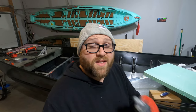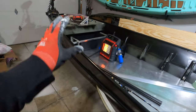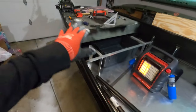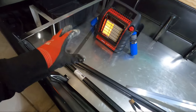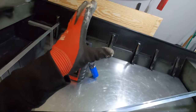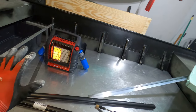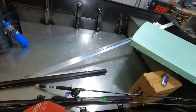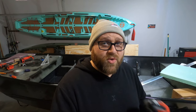As I mentioned in the last video, I've been waiting on a delivery to start any of the wood framing and sealing so I can do the foam — it finally got delivered. Basically, in order to do EVA foam flooring in the boat you need a smooth surface. The aluminum floor is great, as well as the top of the boat, but when I start doing the wood paneling everywhere to close it all up it's not going to be that smooth. Options for that are to seal it in fiberglass resin, sand it down, seal it again — however another product that already dries smooth from the start is epoxy.